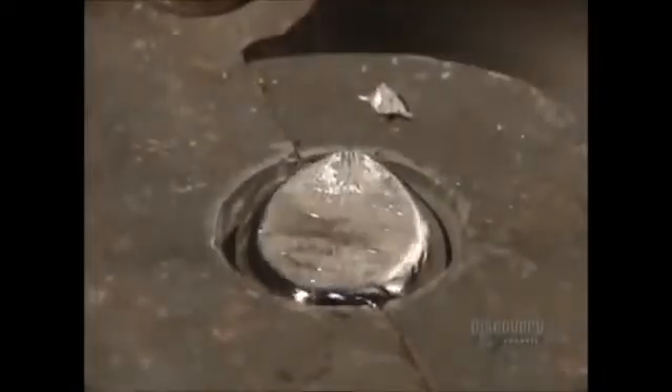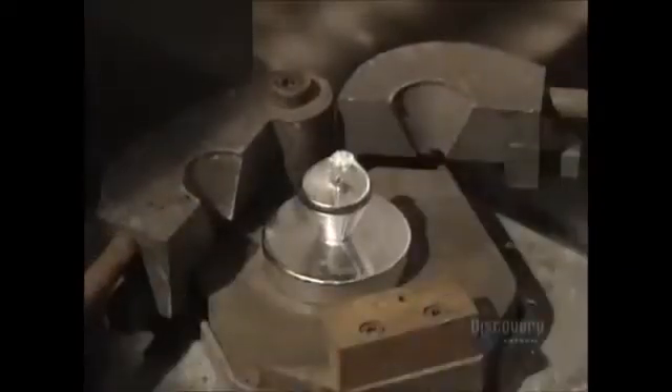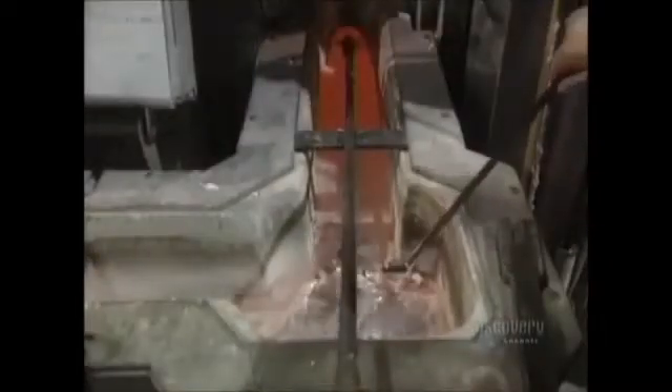The fusion temperature of aluminum is 660 degrees centigrade. A portion of aluminum is poured into a small mold to make a sample. Solidifying in just seconds, the sample allows for testing to verify the contents of the prepared alloy. This trough is used to transfer the aluminum from the re-melting furnace to the tapping well.